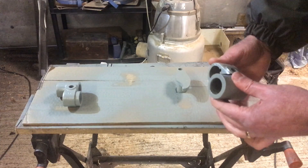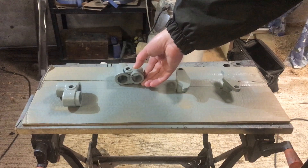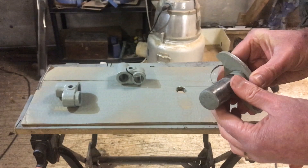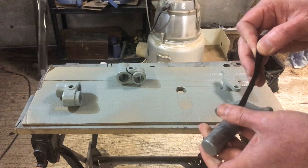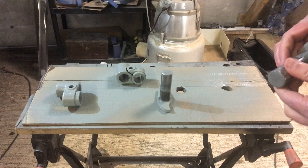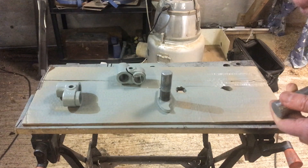I'm hoping that will just wipe out. What I didn't do — and probably should have — is protect the whole shaft. I put some tape around the bottom piece here, which protected that, but I thought I'd have enough control to just spray the bottom and not get on the shaft. The weird thing about this can of spray primer is it doesn't come out like a normal spray paint pattern. It actually comes out a bit like a garden hose — in a thick stream that splatters onto the part you're painting. I don't know if it's the consistency required for primer or whether I've got a dud can.